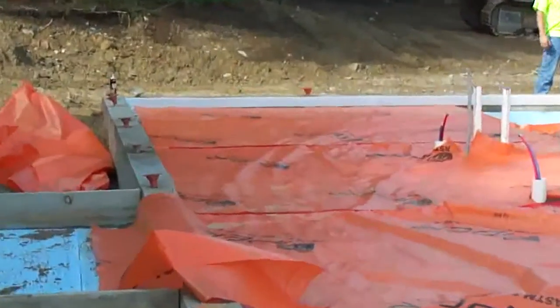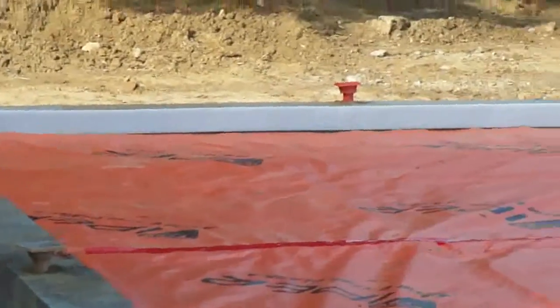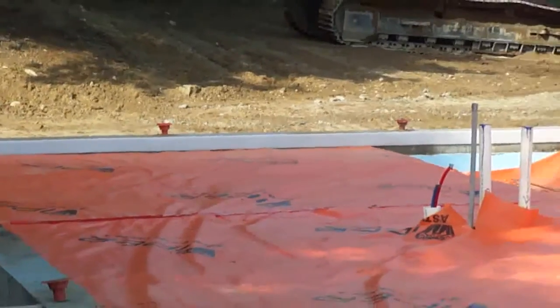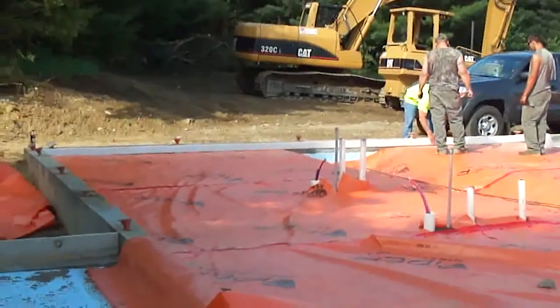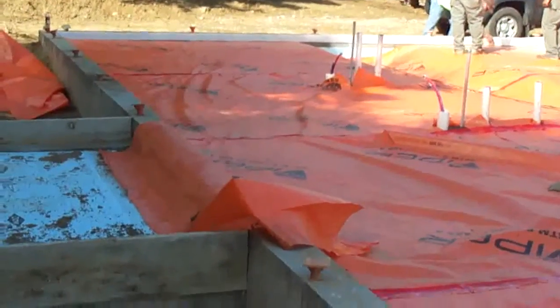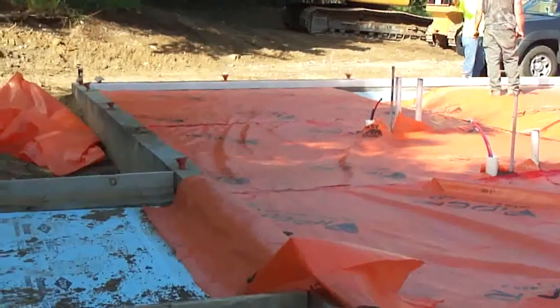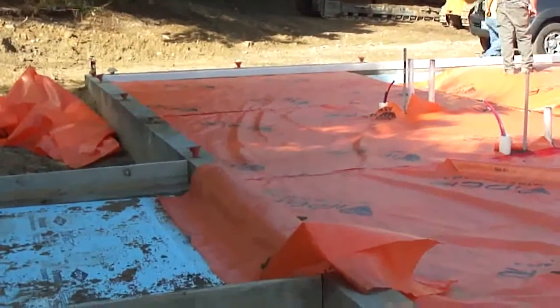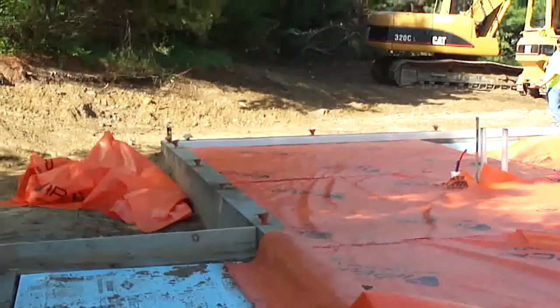On the additional perimeter, as you can see, we're putting in what's called a tearaway — a foam pad that goes around the entire perimeter so that when the concrete slab gets poured down on top of our vapor barrier, you don't have the concrete wall and the concrete floor touching, so that they can independently adjust through the seasons.